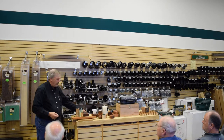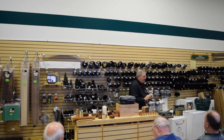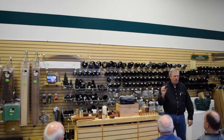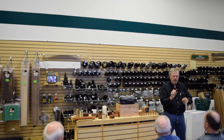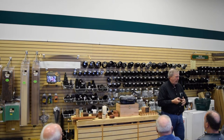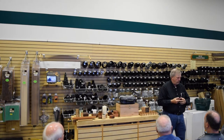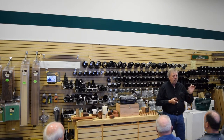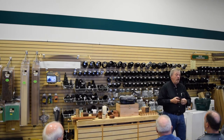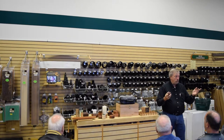If the cigar smoker likes to play golf, you make something like this. Little block of wood, pretty block of wood. You're going to drill a hole here with the lathe. This hole is 1 inch wide. Why 1 inch? A cigar ring gauge is in 1/64 of an inch. So if you have a cigar with a ring gauge of 64, it's 1 inch in diameter. That's a pretty fat cigar. Most of the ones people like are between 49 and 55, 60 tops. So do a 1 inch hole, you're golden.